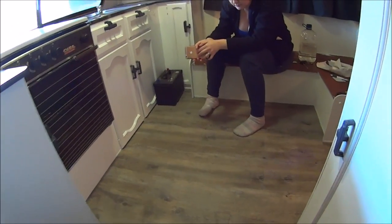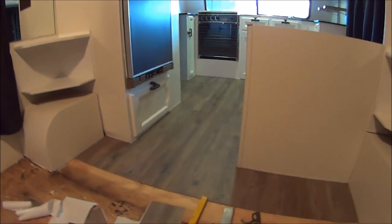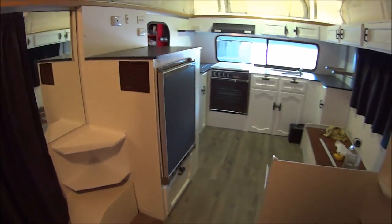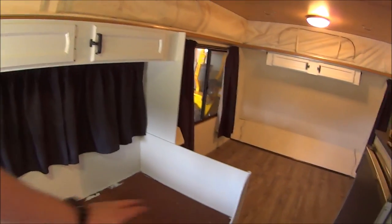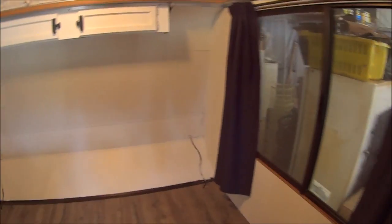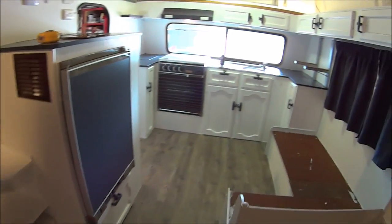We've done the first couple of hours of flooring. This stuff is wicked — it's Senso brand self-adhesive vinyl in colour Pekin. I'm laying it straight on top of the old vinyl. Got a battery to hold some weight down in one corner where it was lifting. To cut it, all you do is score it with a blade and snap it, then cut in around the corners. Apply a bit of pressure to get it to stick nicely — easy! That's the flooring finished. Nothing's lifted overnight, it was super quick to install, and it looks pretty good.